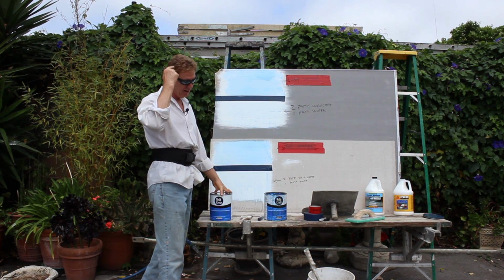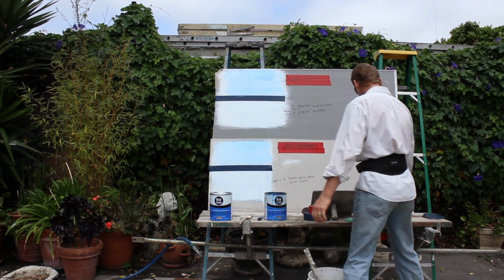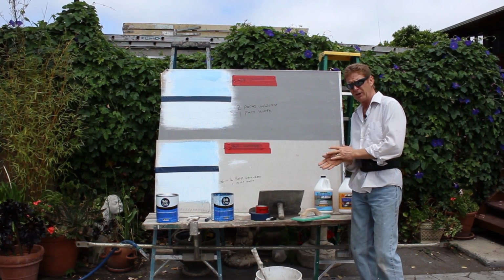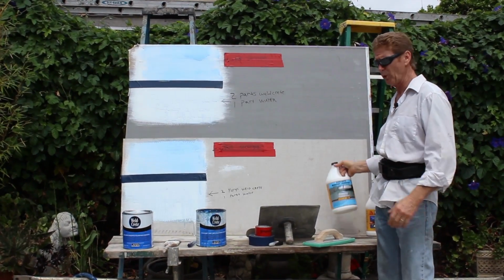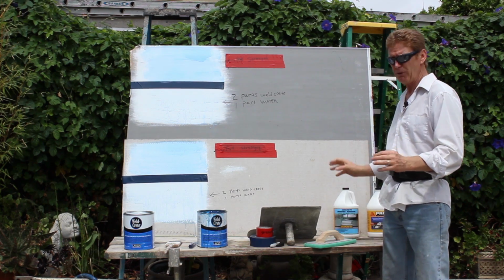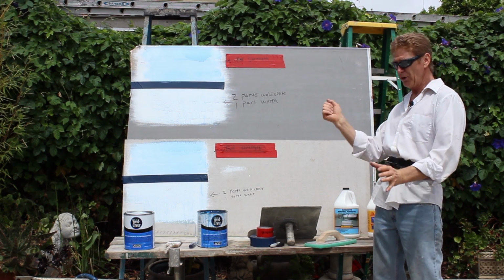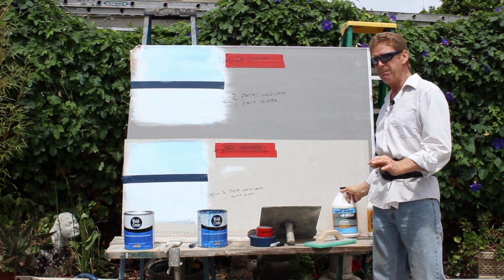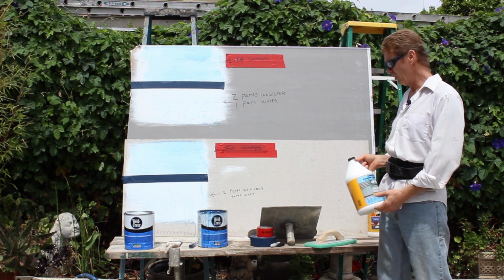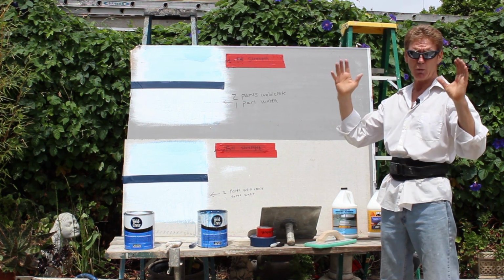While I've got this in my head, let me tell you another story, guys. Not these products. There are about 50 products if you go to various parts of the country or various hardware stores where they say you can put this in the material. They are referring to if you mix a little slurry and you put the coat on the wall, you can do it that way. I've had many people say, well, Kirk, I'm going to put a gallon in my cement mixer and 8 100-pound bags, and I tell them all, it will fail.